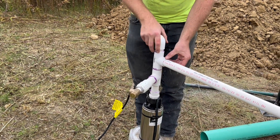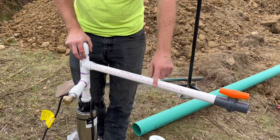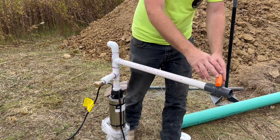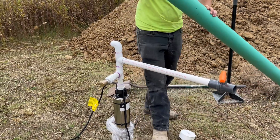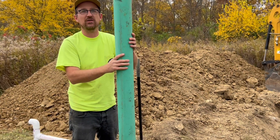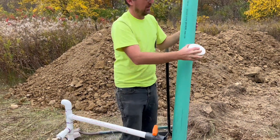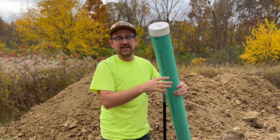Then, as a secondary system, we have a second T here with a straight line to a one-inch quarter-turn valve. This valve will be inside the cistern, but accessible through a hole we're going to drill in the top of the cistern. This 4-inch SDR-35 pipe is going to serve like a valve box to give us access to that valve. At ground level, we just pop a cap on so nothing can get into the cistern.